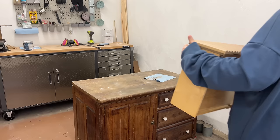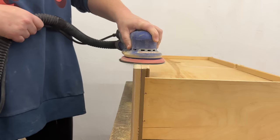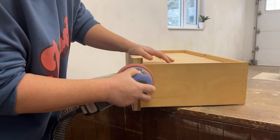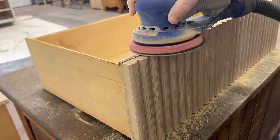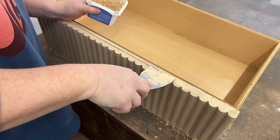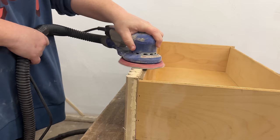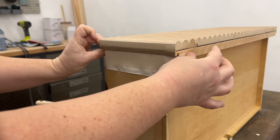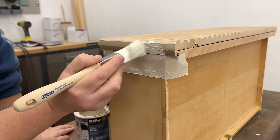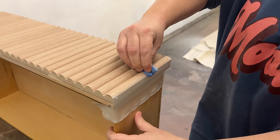Now that all the wood glue on the drawers was fully dry, I needed to use my sander with some 150 grit sandpaper again to smooth down the edges and make sure that every piece of trim was perfectly flush to the original wood. To fill in any seams or gaps around the top and sides I used a bit of lightweight filler and sanded that smooth once it was dry. To finish off the exposed MDF edges on the sides, top and bottom of the new trim, I brushed on a bit more of the same paint used on the rest of the piece, and anywhere I made a mess over the white oak finish I used a damp paper towel to clean that up.